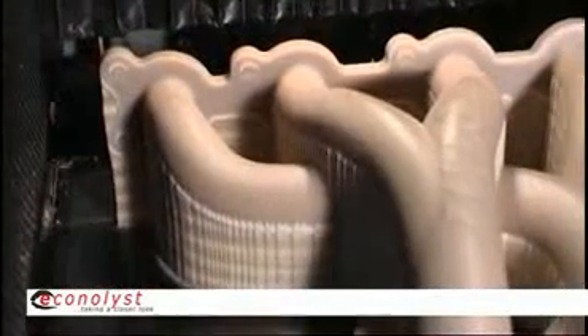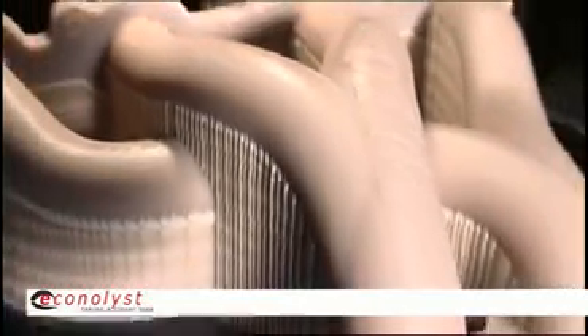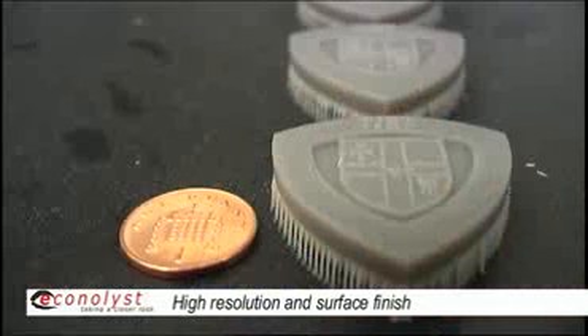When those materials are jetted down onto the work surface in liquid form, they solidify. That material is then cured, that layer is then planarized, and then we jet down the next layer of material.